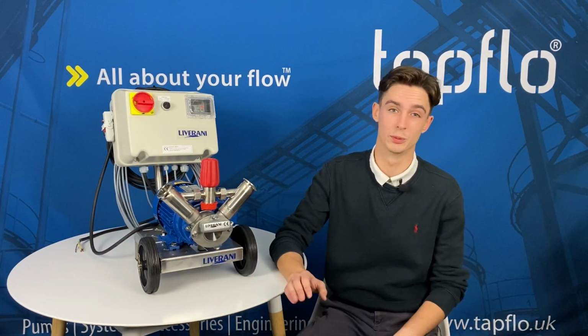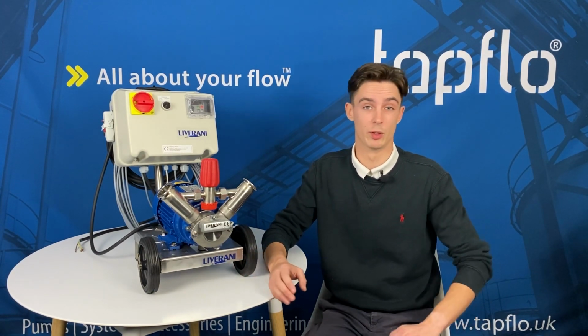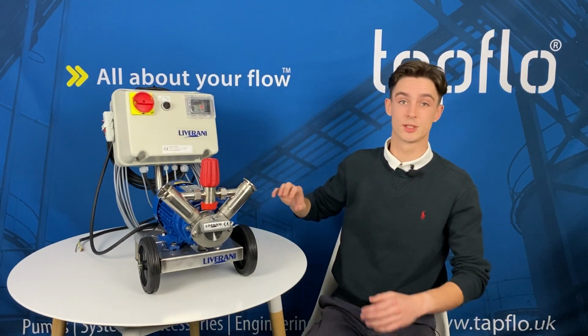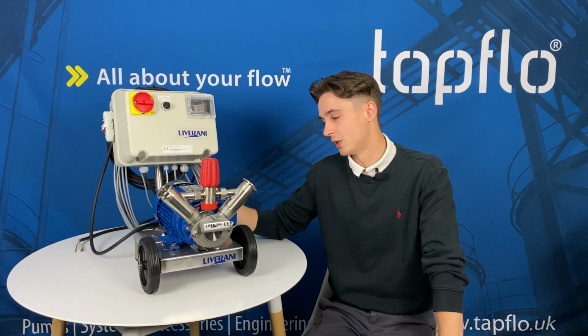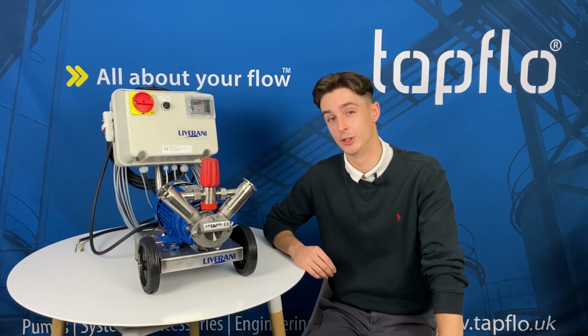So the flexible impeller pump range is actually very diverse. There's a lot of different customizations we can do, so many different options, pretty much you name it. As I said, this one's being done with an FDA approval, so the mechanical seal and the impeller. However, if you're pumping at different temperatures or different viscosities, all that comes into play, and we can tailor-make the pump to meet your specific requirements. For example, this one's got the VSD. If you don't want that, that's not a problem. We can do the trolley without it. It's all very modular. The motor itself, this one's 3-phase. We can even get them down to 12 volt. So it really does depend on what exactly you require.